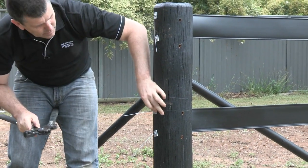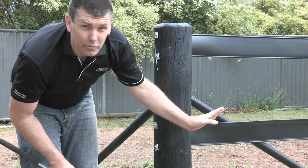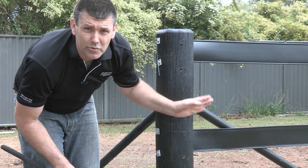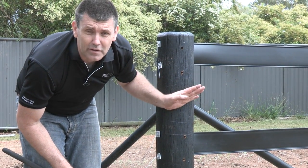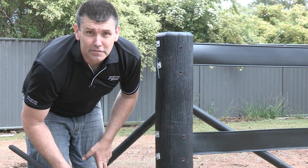We've got that. Now we're going to go to the other end of the fence and put a little bit more strain on the other end where we originally did what we call the dead end post. And that's how you strain a bounce-back horse fence — thanks for watching.